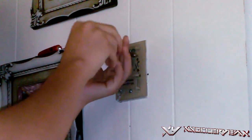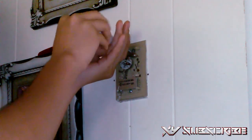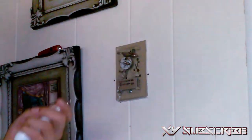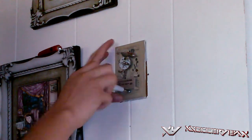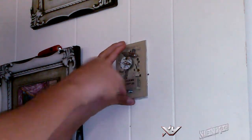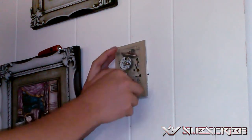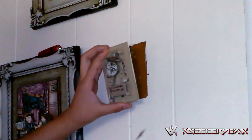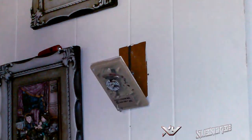And while you're doing that, you could check on your phone, or have somebody else check on your phone, to see if the wires are compatible. The thing is that you're going to want to have a low voltage thermostat, so that'll be good, because if you have a high voltage thermostat, it will not be compatible with Nest, which really sucks, but most people have a low voltage one, so it'll be pretty much good.